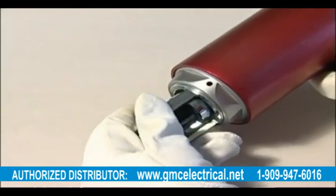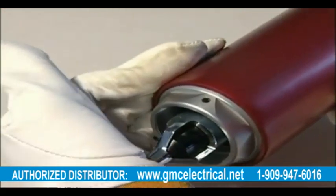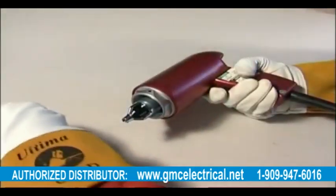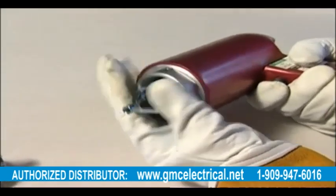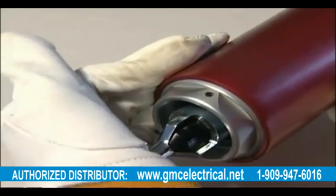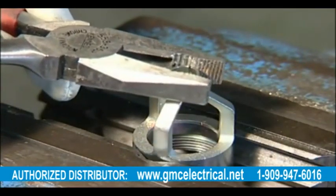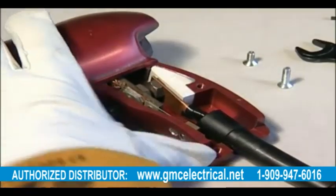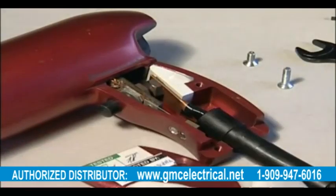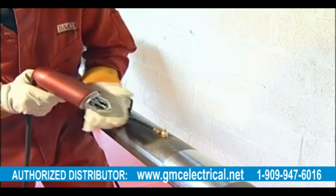Adjustment is achieved by twisting the ferrule holder. Brazing is initiated by the depression of the trigger button, and on systems requiring fuse pins, the fuse section of wire is ejected by depressing the ejector rod button. Simple repairs and maintenance to the gun include ensuring the pin holder and front piece are securely fastened and that the pin and ferrule are a tight fit within the jaws of these holders. If they are flared or misshapen, they must be removed and evenly adjusted either in a vice or chuck. Contacts are cleaned and tightened or replaced when necessary, utilising the allen key and open-ended spanner provided in the tool kit. The contact nipple is replaced whenever any resistance is encountered when trying to eject the fused wire — never force the button.